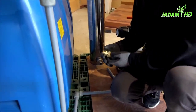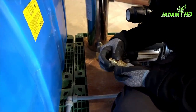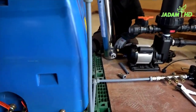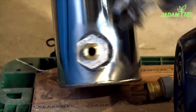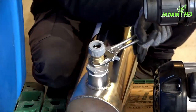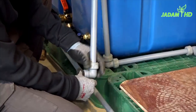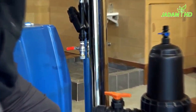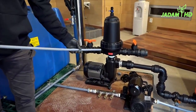Once it is completed, I'll move on to the next step: connecting the tank with the water softener. I'll convert the ordinary socket with a one-touch fitting, then do the same thing with other parts on top. Next, we need to install other thin pipes to be connected to the water softener. For that, I will need 2 PVC elbows because we are going to turn twice. After that, let me connect the other PVC pipe to connect the water softener.